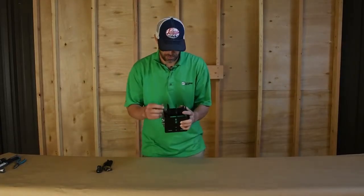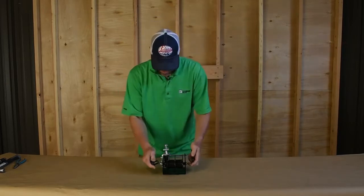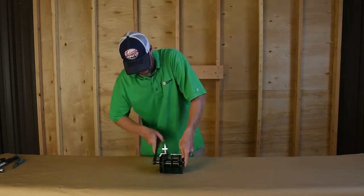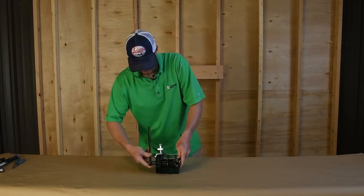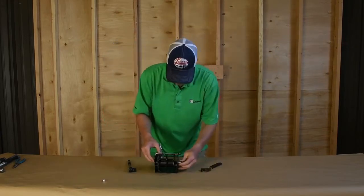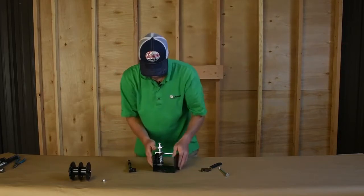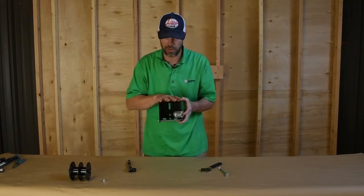Before we hang our crank on the wall we have to disassemble the spool. I'll take my 9/16 wrench and a crescent wrench on the other side and remove this axle — it's a nylock nut again on this side. Set that aside. Inside there's a little floating axle, so make sure that doesn't fall out. It's a lot easier to access the back when you remove that axle, and then we're ready to hang the unit on the wall.